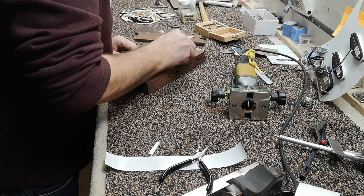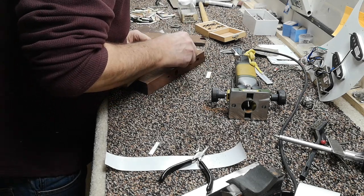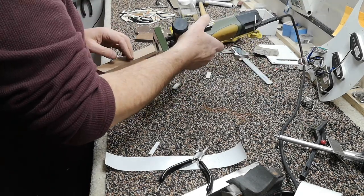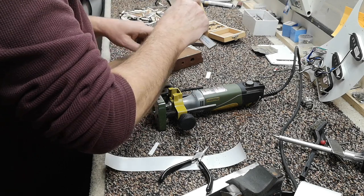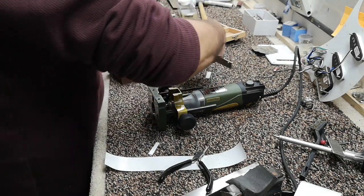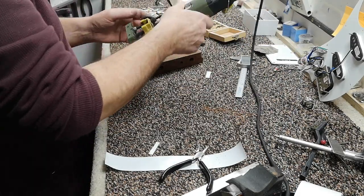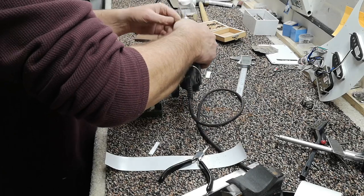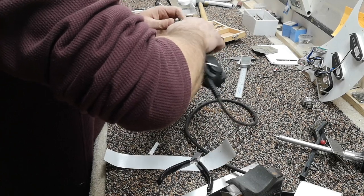That could be argued to be a fraction too wide, so I guess the more you do it, the wider it gets. You can't really get thinner. That's 3 mils, and if this is dead on 3 mils, we'll be in this sort of ballpark where that's always going to be a bit loose. 303, and I bet you this is 339. So just the wandering of this means it's always going to be a bit wider. So we have that challenge to cut the thing. We don't have a narrower one anywhere. I'll have a look around, but I think that's our thinnest thing.